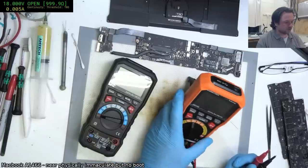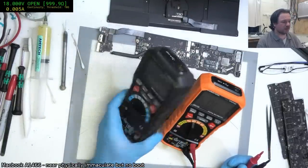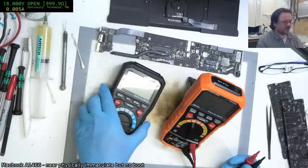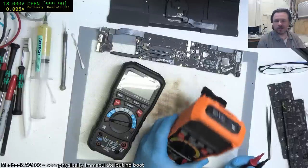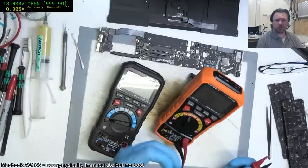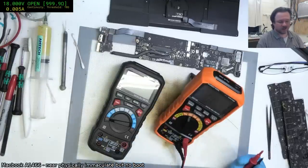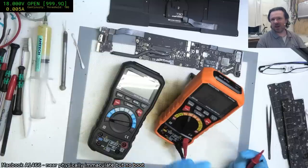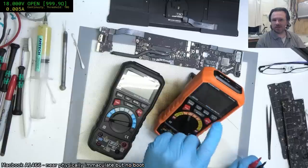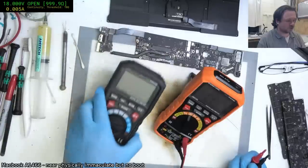One thing I did find that was interesting is that these ones run at 2400 BPS, 8N1, yeah, 8 bits, no parity, one stop. And I could not get my software to work with these ones, and I thought it was a different protocol. But then I noticed that all the values coming out were actually pretty low. There wasn't much going above about 8F on the hex data. And then I realized this actually runs at 9600 BPS. So it was an interesting change between the two models.